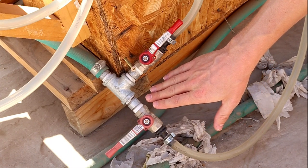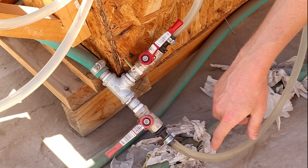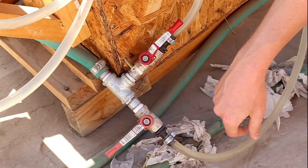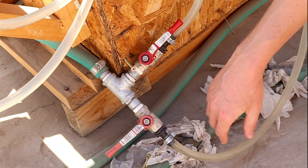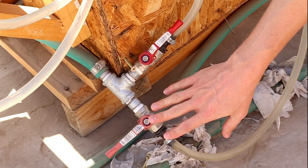The water from the coil is probably around 150 degrees Fahrenheit. We could do about five or six of those cycles a day and that's more than enough hot water for the whole tank. The coil itself probably holds somewhere between a liter and a liter and a half of water, which doesn't sound like much, but it's very, very hot compared to the rest of the water so it mixes in well.